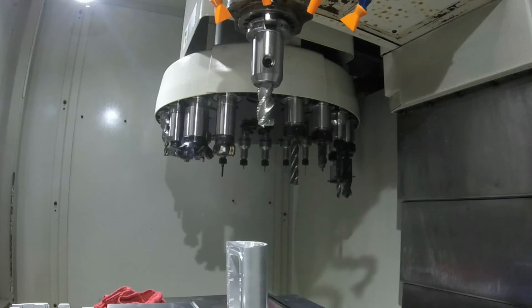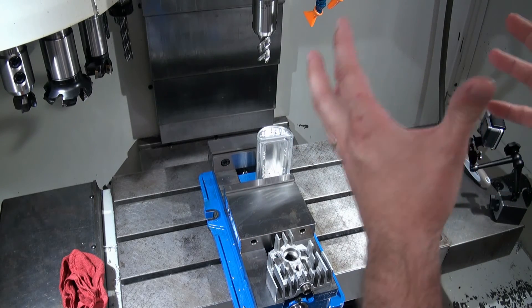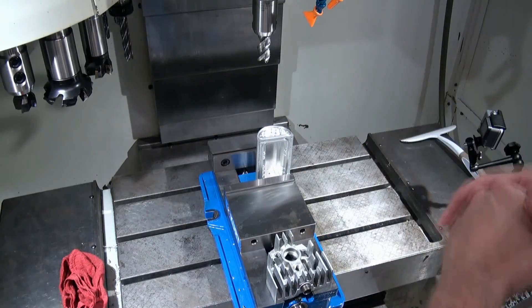As soon as you consider that you need a tool changer, that's going to start driving your costs up a lot. That's the point where a vertical machining center starts to become competitive with the pricing of the newer personal CNC machines. There's a lot of opinions on bulletin boards, forums, and YouTube — some people say don't waste your money on a personal CNC machine, those are tinker toys, go with a big vertical machining center. I don't agree with that statement. You need to make a decision based on what your needs are — there's nothing wrong with personal CNC machines, there's nothing wrong with vertical machining centers. It's which tool do you need to do the job correctly. That's going to wrap up part one of our buying a CNC machine series. We'll see you in the next episode when we talk about location and power.